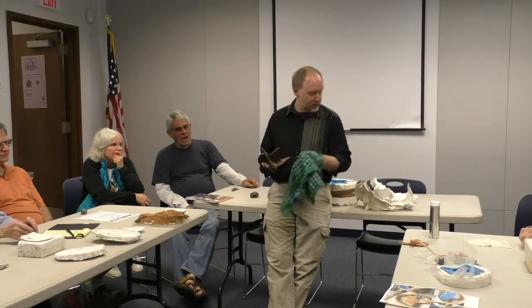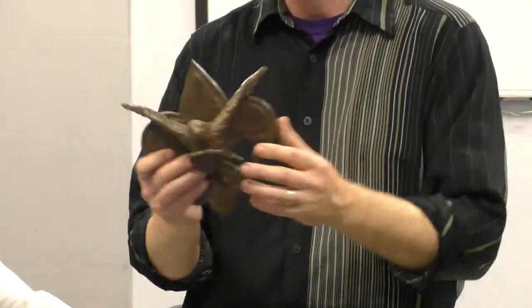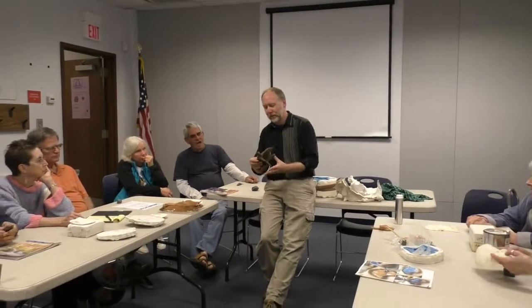So now we have the mother mold. You have your clay model, you put the latex over it, and before you remove that latex from your original model, once it's all dried and set, you pour plaster over it for a mother mold. So this is strong. It could be multiple parts. But now I've got something that will hold the shape that I want with the latex inside there, and I can pop the latex out and easily peel it off my casting. So we have a flexible mold, in this case latex, supported by a plaster mother mold.